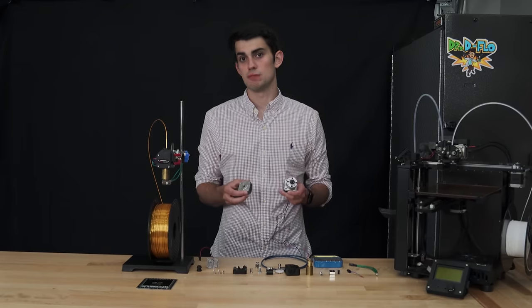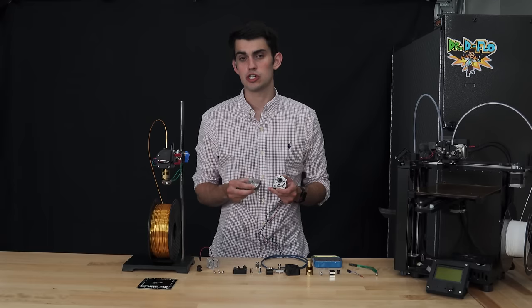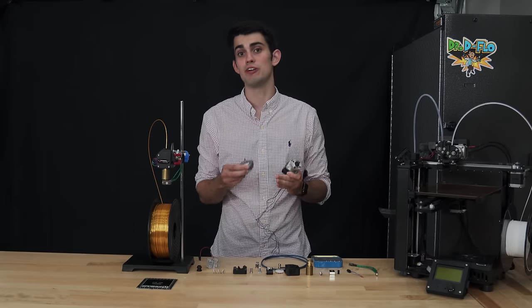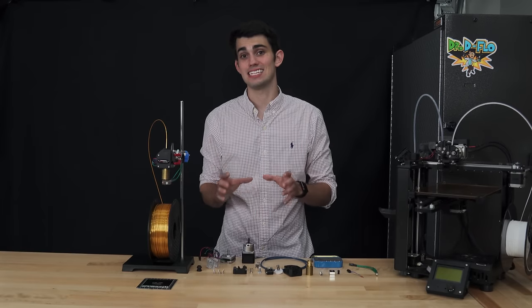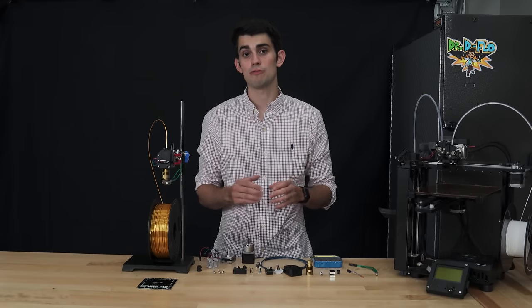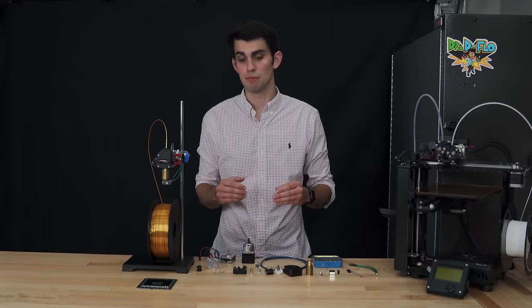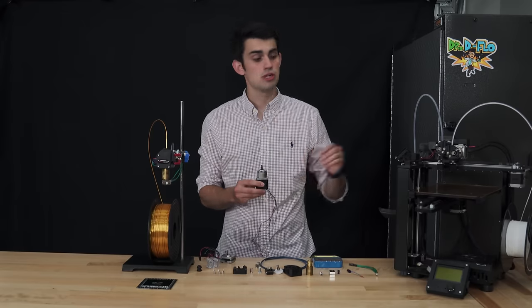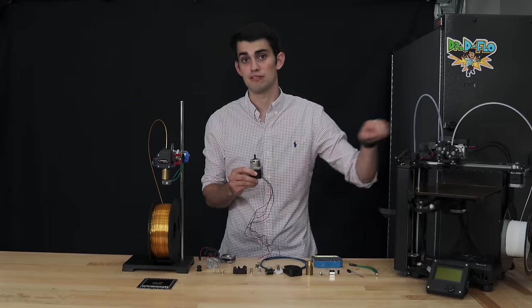We will finish up this section by talking about the extrusion stepper motor. As I mentioned in the stepper motor section, the amount of force required to extrude filament is unexpectedly high. It is best to have a motor that weighs the least, especially for the direct extrusion drive system. Recall from the stepper motor section that we can increase the torque output of a smaller NEMA motor through gearing. The M2 uses nearly the same planetary gearbox setup as we previously covered.